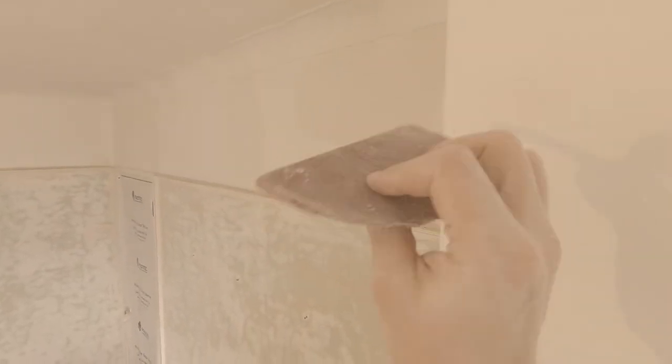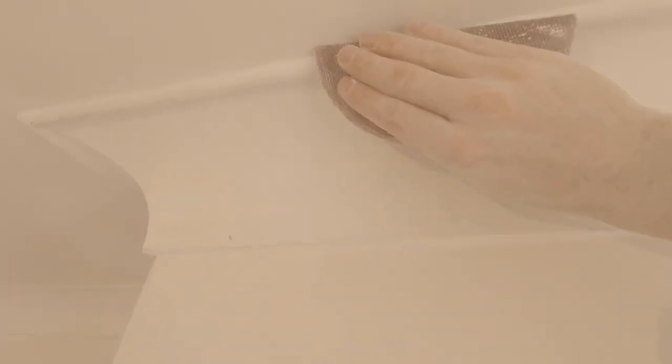I've been using one of the pads off the Deros, just folding it in half so I can work with it. These pads, once they've been used to rub down the walls, aren't coarse enough to do the job on there, but I can certainly reuse them for something like a fine fill up here. I'm just pushing it into the shape of the coving. If you haven't got any of these pads and you're doing this by hand, then sandpaper is the next best thing. I've just folded the pad again and I'm working it in like this — folded, then doing the shape.